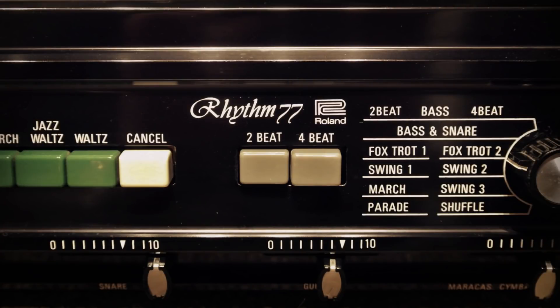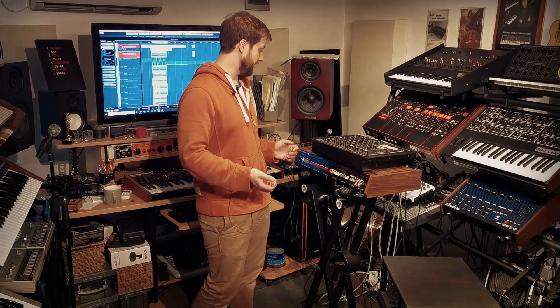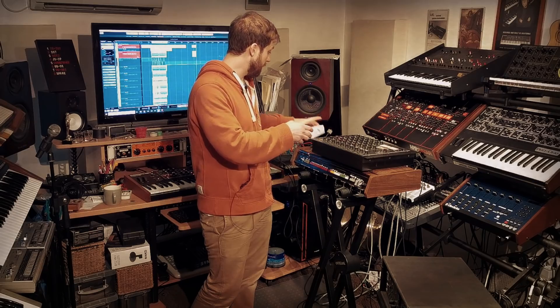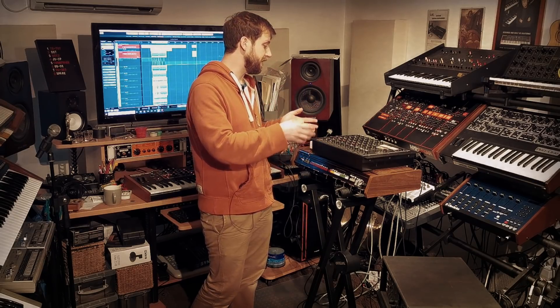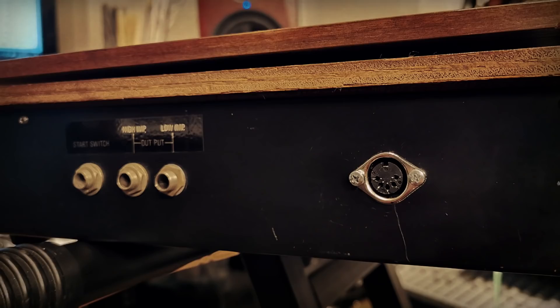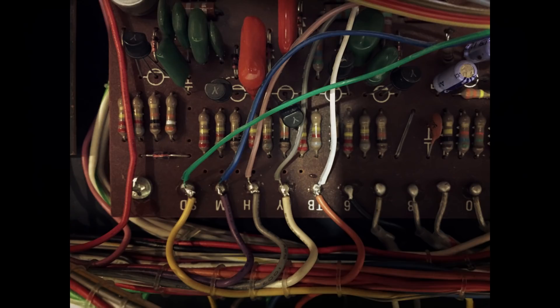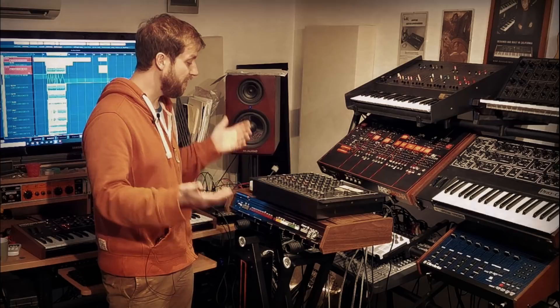It's been out having a MIDI kit installed — the UniPulse universal drum machine interface made by Tabutec. In a nutshell, how that works is there's a MIDI port on the back, and on the inside there's a ribbon cable, and the different parts of that ribbon cable are soldered to the individual trigger points of the individual sounds that the Rhythm 77 can make.